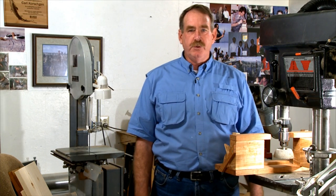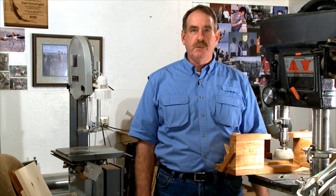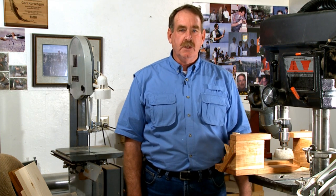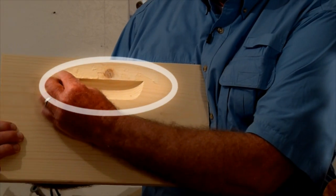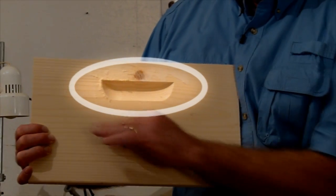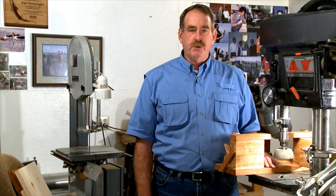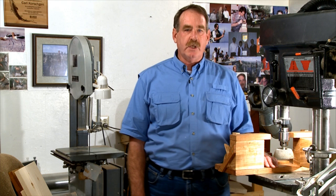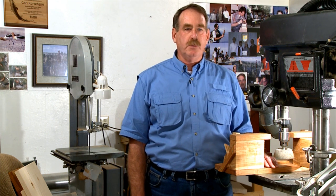I've been keeping honeybees as a hobby for 2 years and have increased the number of hives enough that I decided I needed to build my own hives. In the past few months, I developed a way to cut inset handles into the sides of the beehive using a drill press, a jig that I developed, and a flared contour wheel. I believe this technique is far safer than using power saws with dado or regular saw blades.